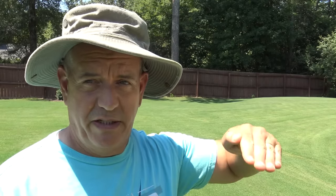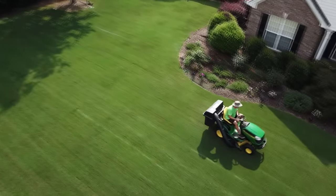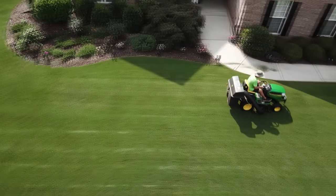The other thing I run into — my lawn is crazy. Ten years of abuse before we bought it. I've got all kinds of ridges all through my lawn and we're trying to cut Bermuda grass with a rotary riding lawn mower down to an inch. So it's really tough to ride through here and not get any scalp marks. I have knolls and ridges — instead of a nice flat piece, I have a ridge. One scalp wheel is here, one scalp wheel is here, the deck goes across and I scalp that knoll. So I wanted a center scalp wheel on the deck — that's what I'm putting in today.